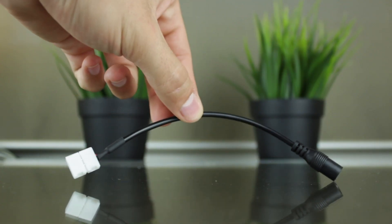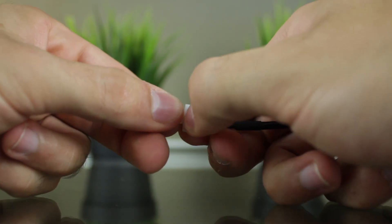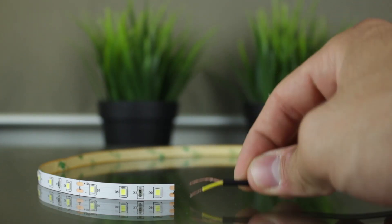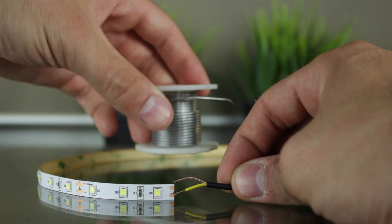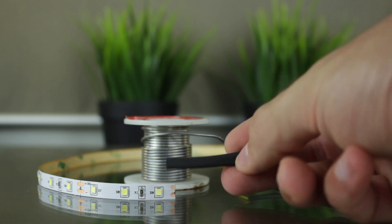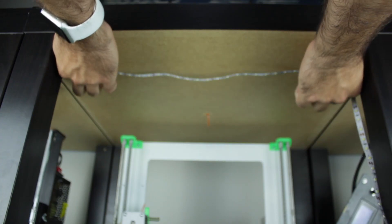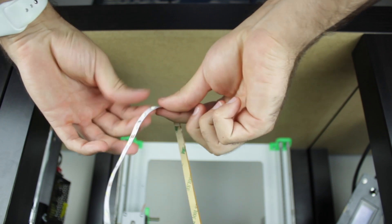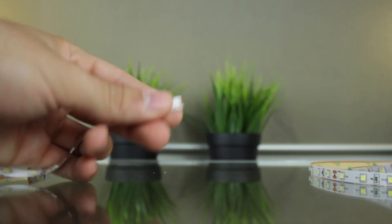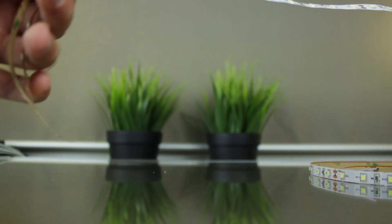The connector is basically a plastic piece that will attach the LED strip to the cable with a simple click. The solution is easy, but I prefer to get a better visual result, so I'm going to weld the two cables to the LED strip using some tin, and later cover it with heat shrink tubing. Back at our structure, if we measure the bottom of the table, we can see that we could cut the LED strip right here, around 45 cm long. We are actually going to cut two portions since it will provide twice the light, which is really convenient.